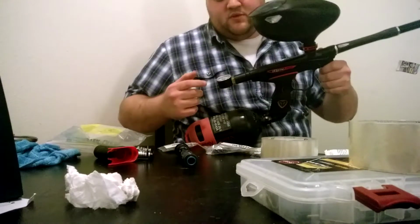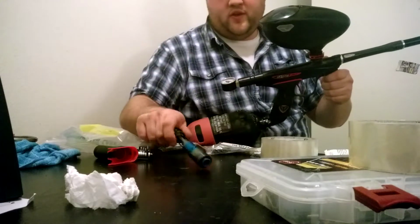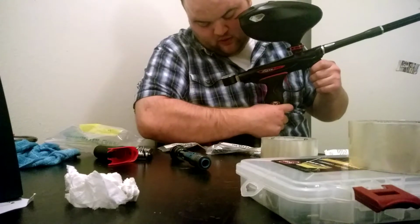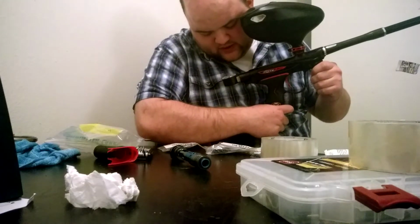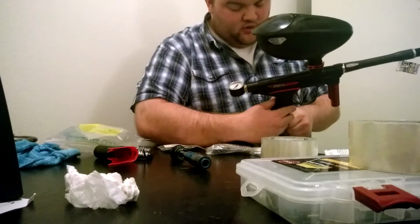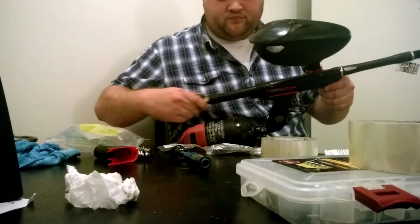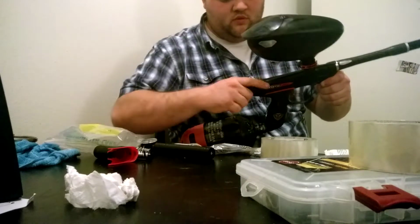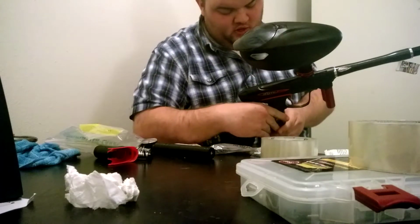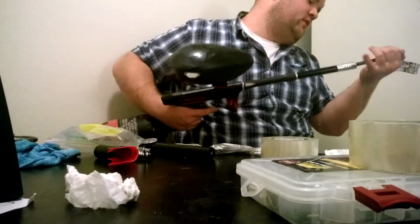Gauge. It seems the transducer reading will change depending on whether you have a bolt in or a pressure tester in. Pressure tester is basically saying 45. Transducer agrees at 45. Now with the bolt, it's okay, 44, so we're back on track.